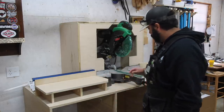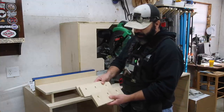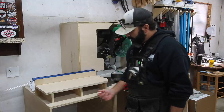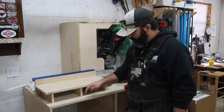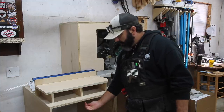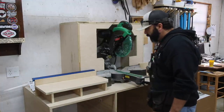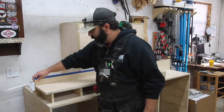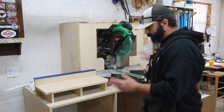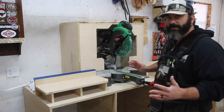The tables I'm making for each side of the miter saw are just three-quarter inch plywood with simple little legs — little pieces of wood with pocket holes. I'm attaching them to the bottom of this tabletop and then I'll secure this to the cabinet by screwing up through the bottom of the cabinet top into the legs. I'll also have a stop block system with t-track and swing arms, and I'll do the other side as well.